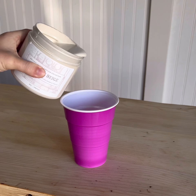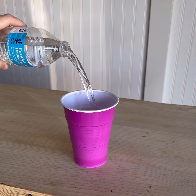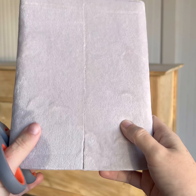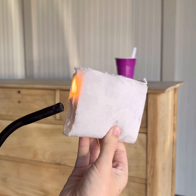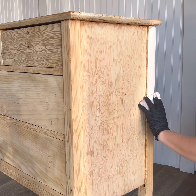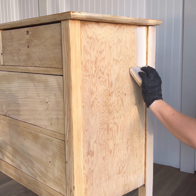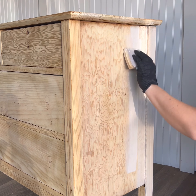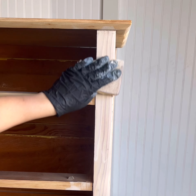After bleaching this antique, it was time to give it a paint wash. I grabbed a new beige paint from Melange Paints and mixed it with some water to create a wash — I usually eyeball it, but it ends up being around a 50-50 mixture. Then I grabbed my staining pads, which are one of my new favorite products. They come in a sheet for you to cut off the desired amount, I singe the sides to prevent shedding, and they hold the perfect amount of product and leave the smoothest finish. They have a foam center and a microfiber outer layer. I applied the wash by wiping the rounded side with the product, and once the surface was covered, I used the dry side in one long stroke.